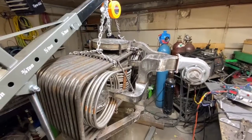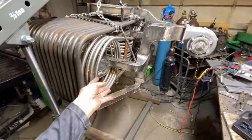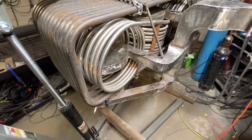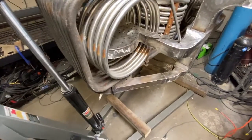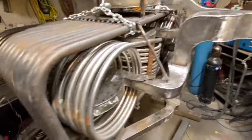Okay, so that took about 15 minutes to balance these, because as I said, when you change one valve, you change the flow on every burner. It increases or decreases depending on what you do to this. So I had to walk through the whole thing several times and dial it in. As you can see, each valve has its own setting. This one here was completely off at one point, and it was still shooting out 2 meters a second.